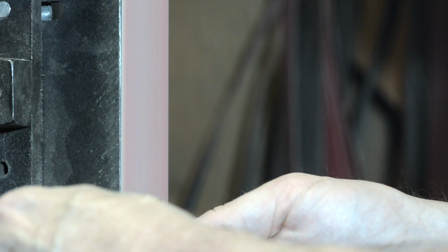So the key to compound grinds is that you have to look at each one as a separate chunk. Now, you may be able to get through the whole thing in one pass, but as a general rule, I recommend that you start with one of the curves and then move to an additional curve. Let me show you how this might work.